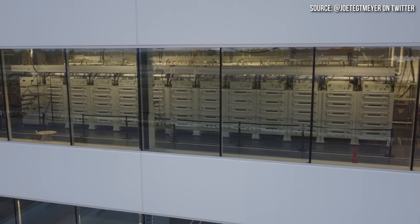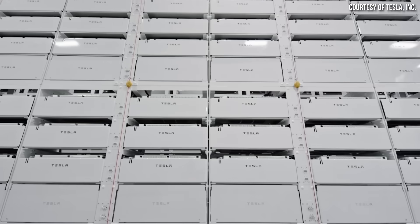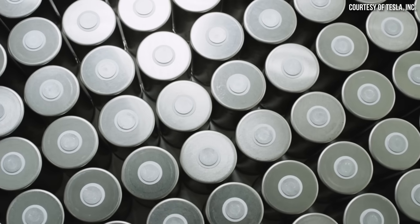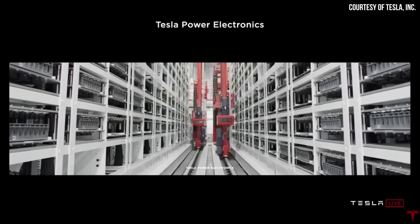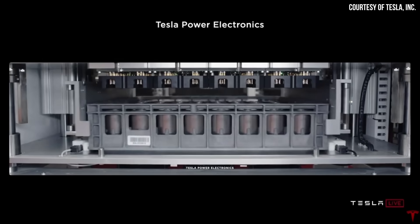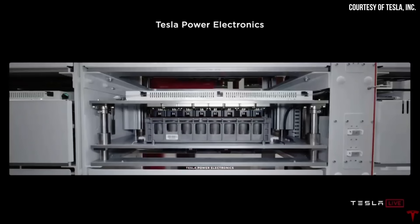The last image appears to be the formation section of the battery manufacturing process. Before a battery cell is ready to be used in a vehicle, it must go through a formation process where the battery is charged at a very low current and discharged. During this process, the SEI layer forms on the anode of the battery, which is extremely important. The battery cell also goes through various tests and is graded for performance — A grade, B grade, etc. — and only top-grade A cells make it into EVs due to their demanding performance requirements.